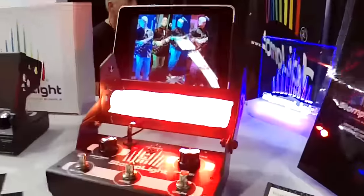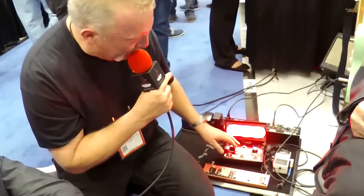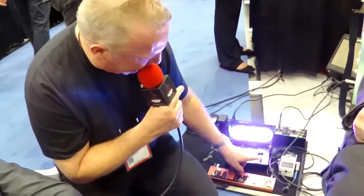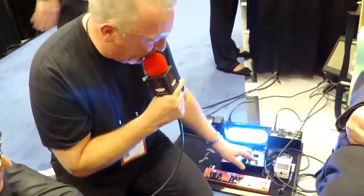You can actually create a color and add it to the palette as well. The next mode is sound active — the classic color organ. In this mode, we have a spectrum analyzer that listens to the sounds and matches them up with colors. There are eight different presets, with frequency ranges starting at 60 Hz going all the way through 5,000 Hz.